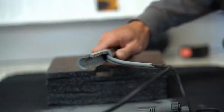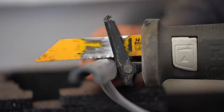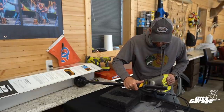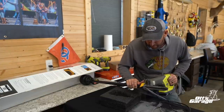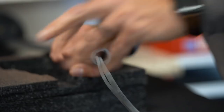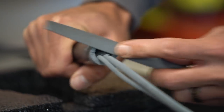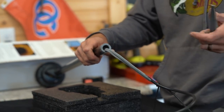So now you want to be very careful on this part. You could put the file on the other side — it's definitely not a bad idea — but I'm just going to go real easy, especially once I get over halfway through. Kind of roll that around a little bit and try to cut that at an even amount. When you get close, it's not a bad idea just to break it, then you can file off the rest. So I'm going to take my file that I was using as a guard and now I'm actually going to use it as a file. Don't rub against the wires, obviously — let's go around that and take any of the burrs off.